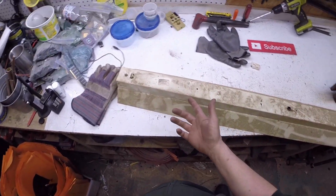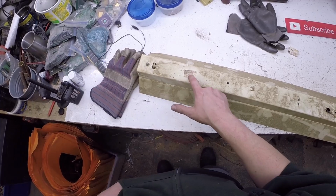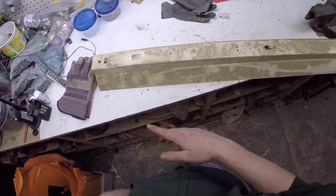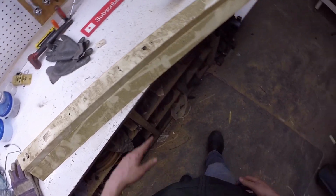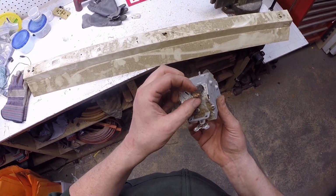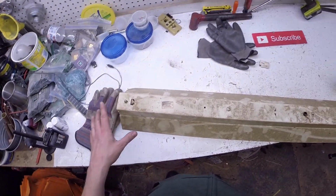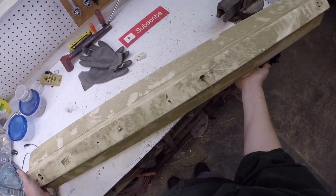Now, in 1979, they banned the use of PCBs. And I looked all this up, Googled it, good old Google, 1992. So, one good way to tell how old it is is by the wiring. Now, you see these wires? These wires are way too modern to have PCBs in them. Now, if the wires look more like this, see, it's like the fabric-coated kind of wires, you can guarantee if a fluorescent light is using this wire, that there's PCBs in it. But anything manufactured after 1979, no PCBs. Well, it shouldn't have any PCBs because they were banned.